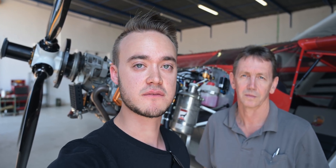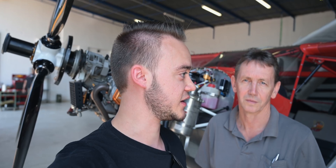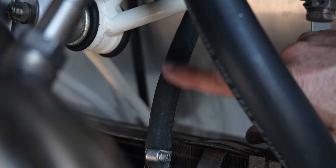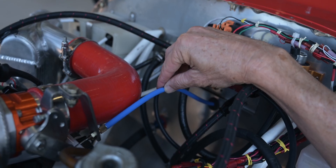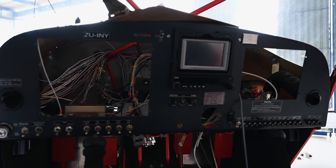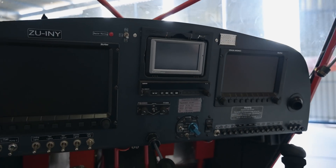While waiting on the prop and a few parts, we decided it's time to redo the firewall forward. When putting a new engine on, there's no point in staying with five or six year old hoses. All the rubber hoses, oil hoses, and fuel hoses were renewed firewall forward, including a brand new throttle cable specifically for this engine. The electrics were slightly different between the Rotax 914 and the Edge Performance engine, so that involved opening up the wiring harness on the inside and changing some of the engine monitoring parameters.